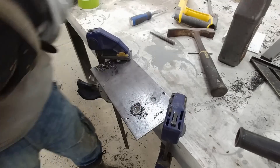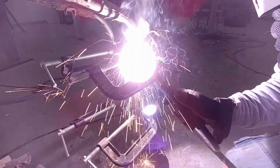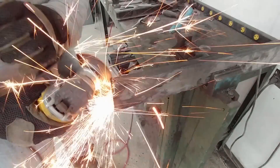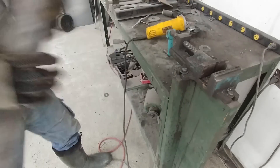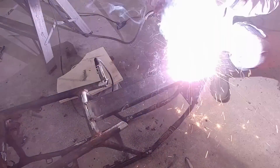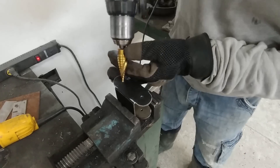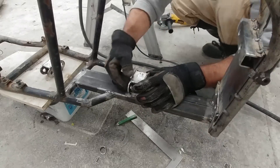The steering column's position is just as crucial as the suspension geometry because if the Ackermann steering geometry is off, nothing will work properly. By Ackermann geometry I'm referring to the geometry of the steering components in relation to the rear wheel axle — specifically the steering arms that the tie rods attach to. They need to point directly at the center of the rear axle when the front wheels are straight in order to produce the desired effect, which is turning the inside wheel to a sharper angle than the outside wheel when taking a corner. Because the outside wheel is further away, it needs to follow a larger radius when going around a turn, so the angle of that wheel needs to automatically adjust accordingly as it's being turned, and Ackermann geometry is what achieves this. It actually took me a few attempts to get it right because I had so little space to work with in the frame, now that the suspension is mounted to the center of the vehicle instead of the outside. There's a better suspension geometry that doesn't create this problem and actually provides more lean angle too, but it involves more moving parts and requires tools that I didn't have at the time.